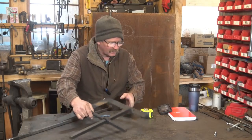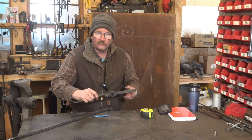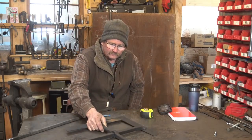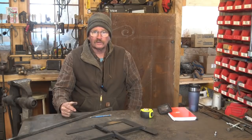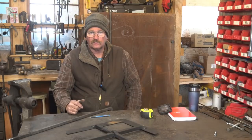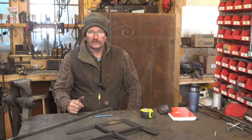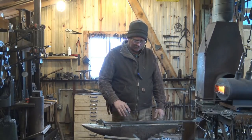But slitting and drifting is good for stuff like this where I'm passing a 3/4-inch square bar through another 3/4-inch square bar — that's a classic use for slit and drift. We will discuss slitting and drifting and how to do a test piece to calculate whether your stock shrinks or stretches, and what happens when you slit and drift. We will do that as a separate video, and I'll try to follow this one up immediately with that video so you can see both methods. The first thing we have to do is lay out for our holes to make sure we're punching right where we want to.